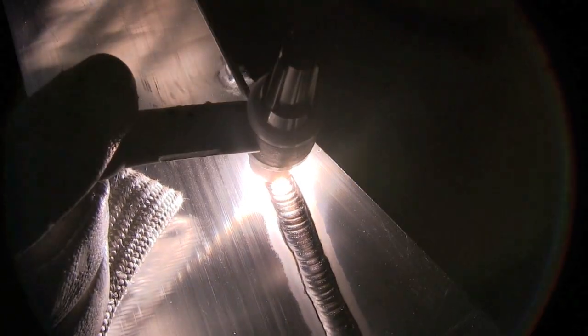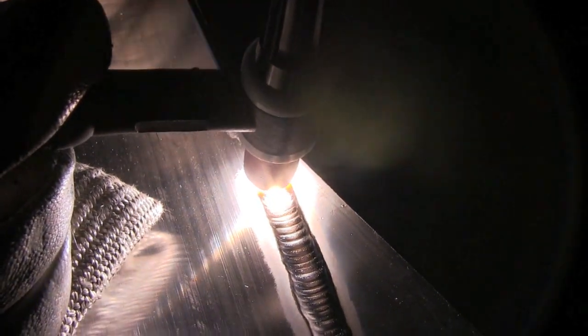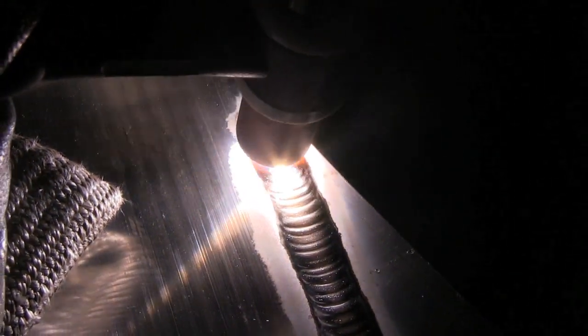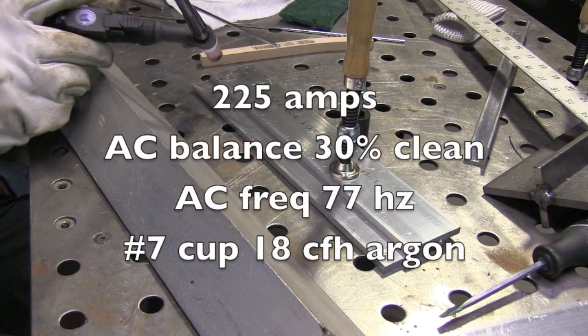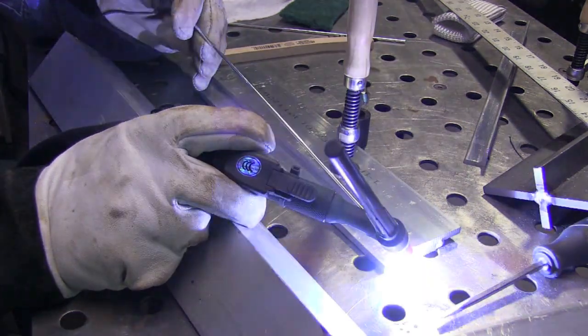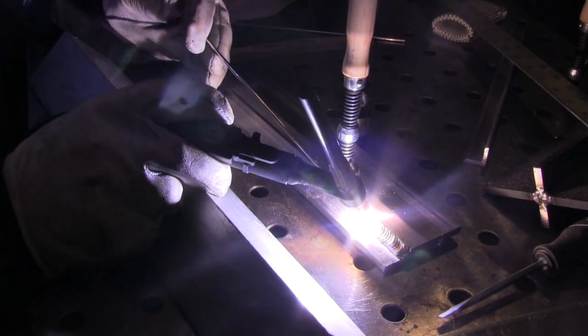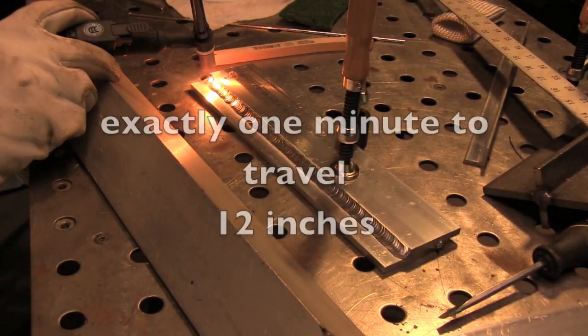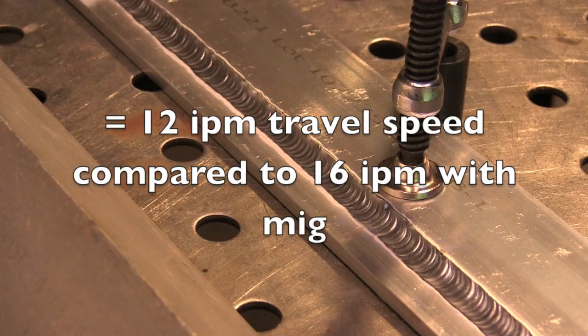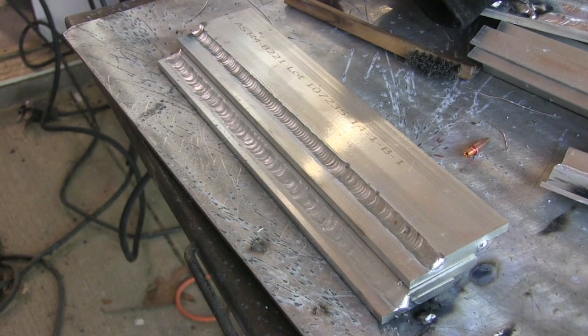I could go just about as fast as I wanted with the spool gun on that joint, but even with TIG I'm going probably 11 to 12 inches per minute. We decided to use TIG in the shop because this particular weld will be visible from passersby — one of those welds right when you walk up to the entrance where the awning is going to hang. We kind of wanted it to look as good as it could. For the field welds, we'll use the spool gun off a generator. I also set up a lap joint quarter-inch with TIG, going as fast as I could while still maintaining control — filling in that quarter-inch fillet, not chewing the edge off. That took exactly one minute to travel 12 inches: 12 inches per minute, compared to the 16 inches per minute with the spool gun.